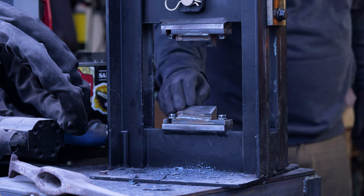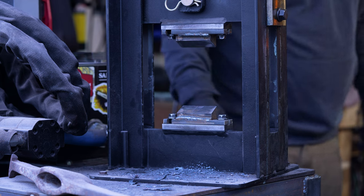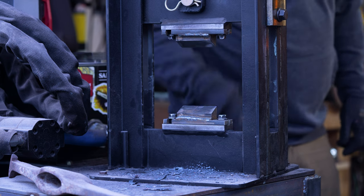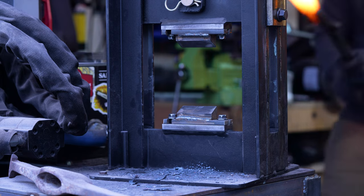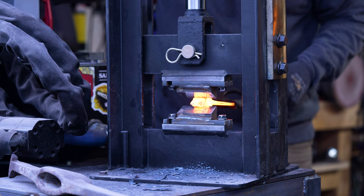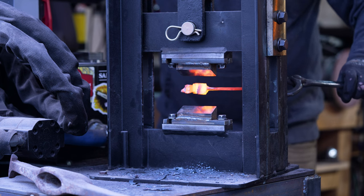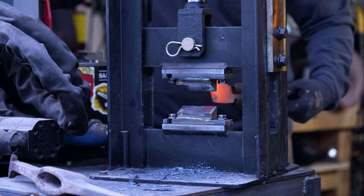Here we've got the butcher block — you can see it's angled down with a sharper point. What that's going to do is basically isolate the bolster for me: it cuts right where I want it and pushes the material out. So figure out where you need it, cut that way, cut that way, and you can see we have a nicely isolated bolster right there — beautiful.